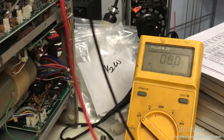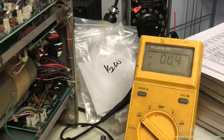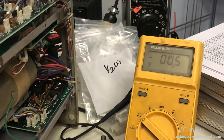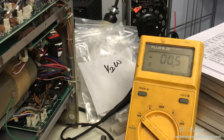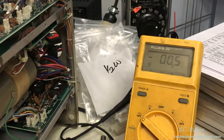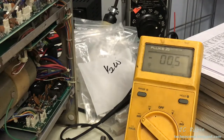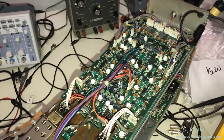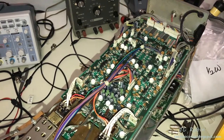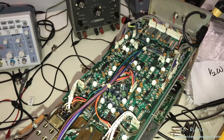On this particular board there are so many differences in which resistor is what that you really couldn't make any adjustments even if you wanted to — we're pretty much only checking at this point. Checking the other three channels: the cabling and test points seem correct, although the resistors are not. Test points 17 and 18 for channels three and four don't even exist on this board, so I can't even test channels three and four.